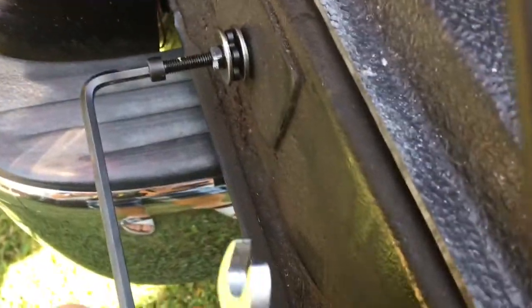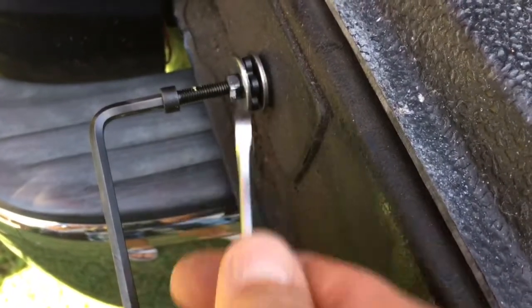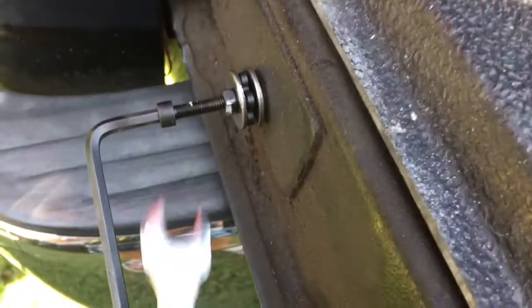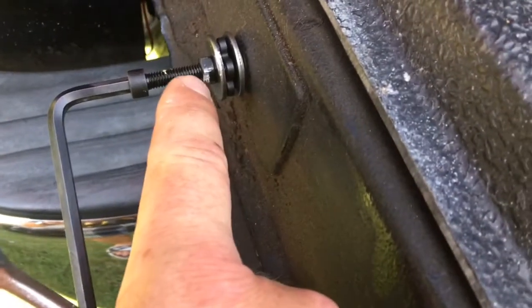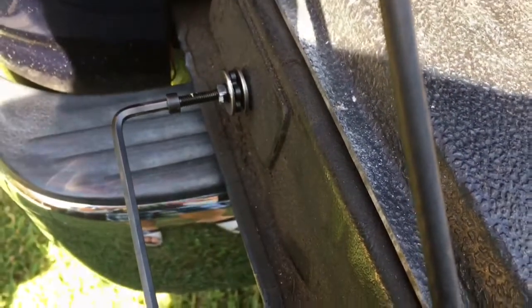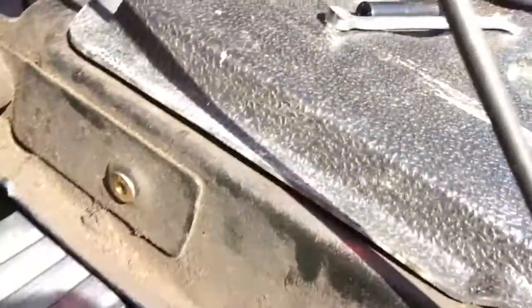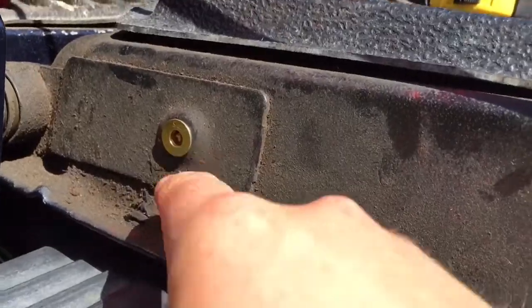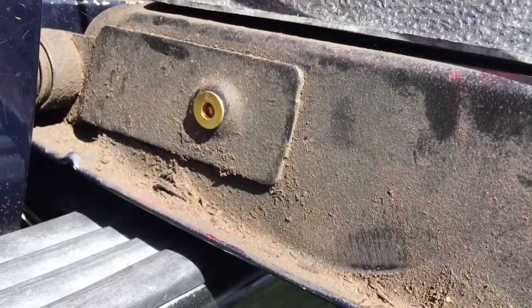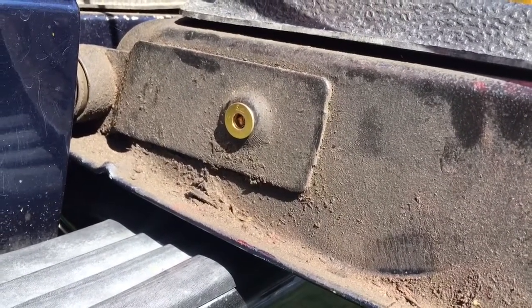What you're doing with the allen key is just holding the bolt and turning the nut itself nine times 360 degrees. You can see I marked it with a little white paint marker — that's pretty simple, it went really easy. Apparently a lot of people have a hard time with this nutsert, but I just did it no problem. I'm no expert, but it was easy.